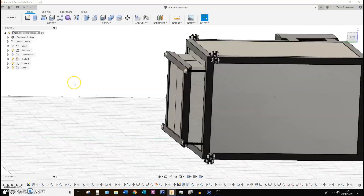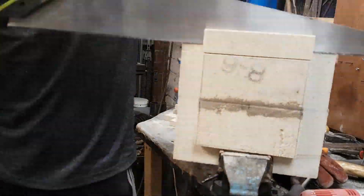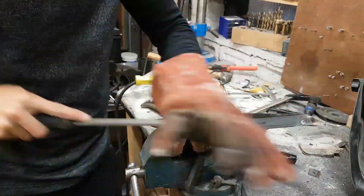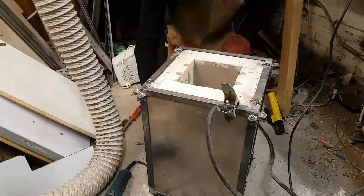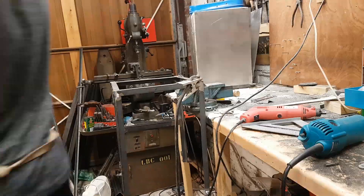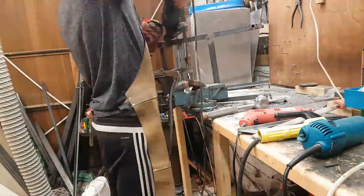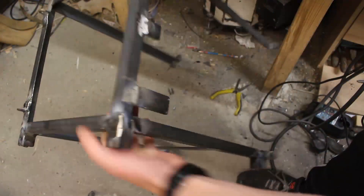The rear of the oven is very simple — it's basically just two fire bricks glued together that are then held on by a metal frame that's bolted onto the main frame. I glued two fire bricks together again and then shaped them down using just hand tools like a wood saw and wood rasps and files. The steel frame was made in the exact same way as the others and fits around the bricks. That then fits into the back of the oven and is held on by some M6 threaded rods with welded-on nuts. Once tightened up, the fire bricks are held very securely and create an almost airtight seal. The next step is to take the frame apart again and complete all of the incomplete tack welds. This process took absolutely ages — a lot of welding and grinding — but finally the frame was done.